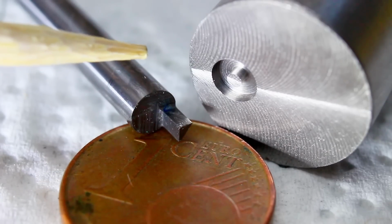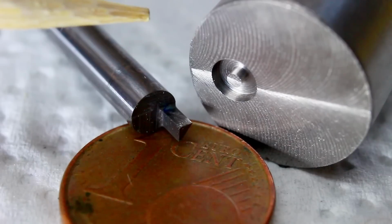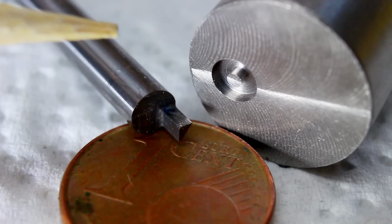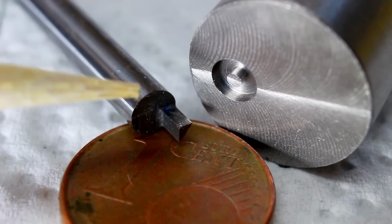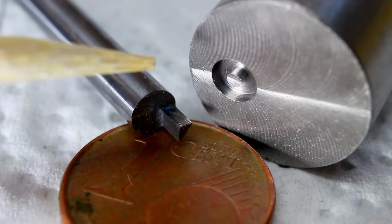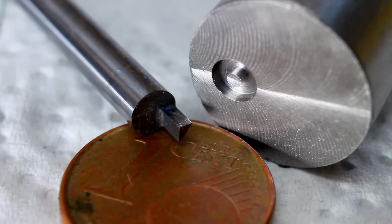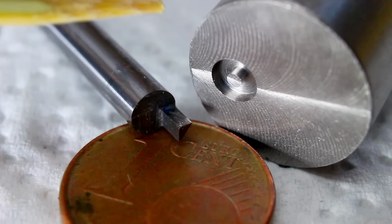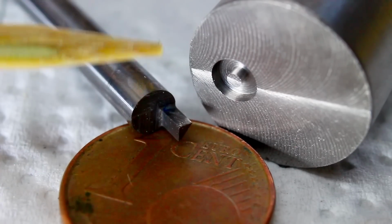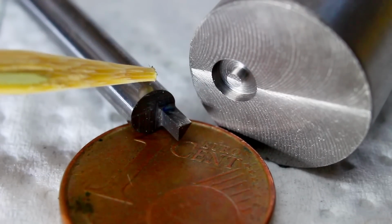The operation I'm doing requires two tool changes. I'm changing from a relatively short collet with an end mill to do some milling on the part to a boring head, for example, with the trepanning tool. And there is an immense length difference between those tools, and there's a lot of Z-axis cranking or power feeding. And if I can, I don't do that. So I made this tool to be just as short as a small end mill, and this will solve this problem. So I ground already one.